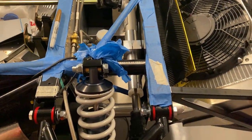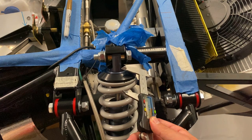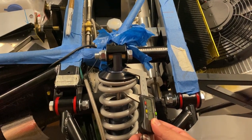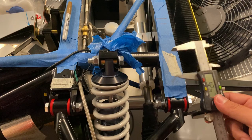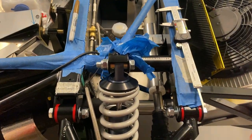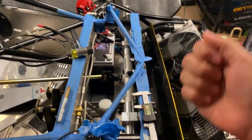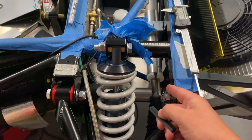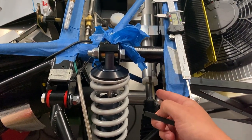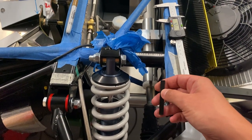Now we've got the steering rack locked in place and tightened using a torque wrench so you don't crush the rack and destroy a very expensive piece. We're going to use a set of calipers and measure between the rack itself and the mounting point — at this end, at the other end — ensure the rack is centered, then lock it in place. This is important for when we set the center of the steering wheel, because we want to align it upright so we don't end up with the steering wheel on the skew trying to drive straight down the road. The manual recommends fabricating a bit of angle that's 61mm long. I measured both sides and it came down to about 59.42mm as the middle ground.